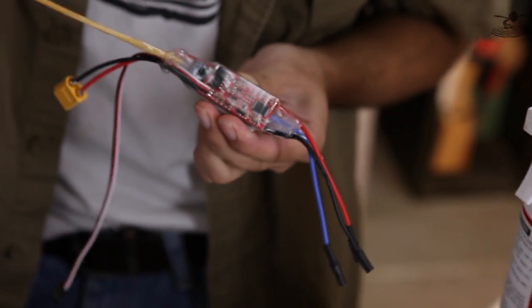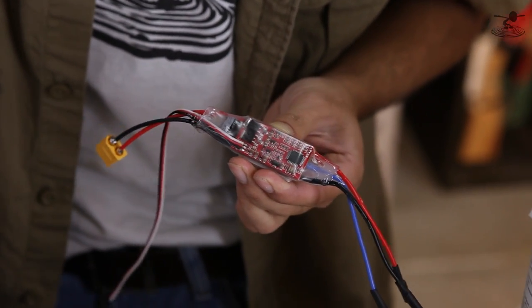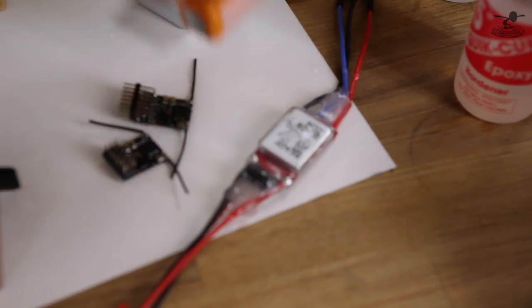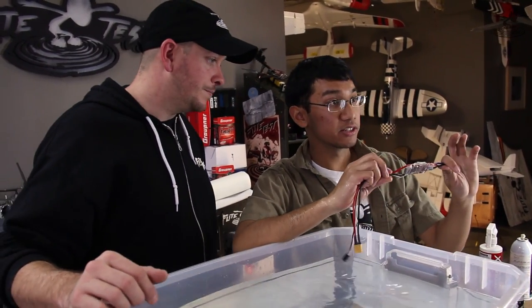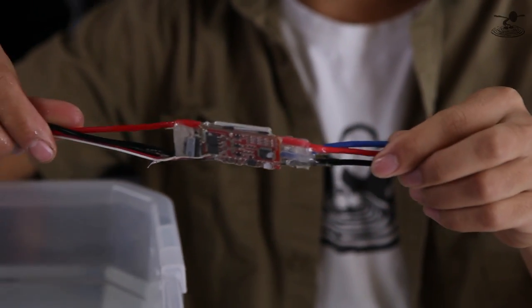So I see you're wiggling around the wires — that's to kind of work it down in there, just make sure it's fully seated and doesn't get anywhere inside underneath the shrink wrap. Now, we just let that dry for about five minutes. Whichever epoxy you use, dry it for the full cure time. In my experience with epoxy, take what time it says and give it triple or quadruple that amount of time before you handle it. Usually it's about 24 hours for almost everything. Here's an actual epoxy one that's been sitting in the tank the whole time — beautiful.